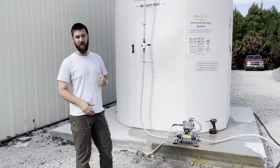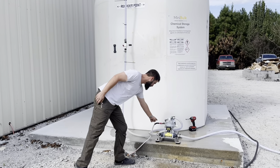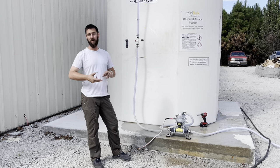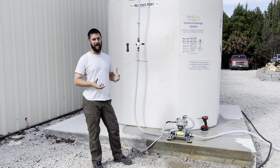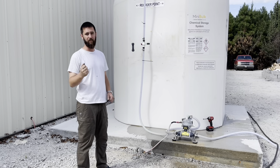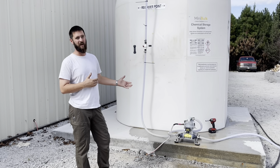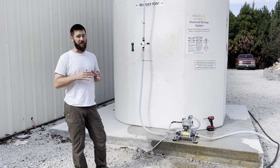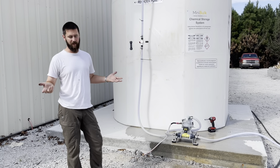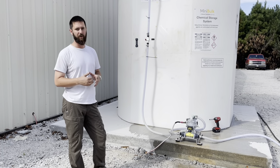They're really good for stationary use — we've got a compressor in the shop. The problem is, we've never gotten around to properly regulating the incoming air pressure to this pump. We put a regulator on it, put another regulator on it, and we've got a regulator at the compressor, and it's just not right. It's sending too much air. Our compressor does double duty — it sends air to this and also to the paint booth out back where we spray our trailers with Line-X. We're using one compressor for two things, and it's running at 150 PSI. It needs to be about 100 PSI or less for this specific pump, and we keep going through pumps. Today we're going to fix it — get another compressor dedicated for this line, put a good regulator on it, and keep that PSI down.